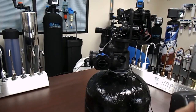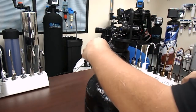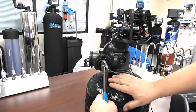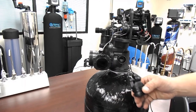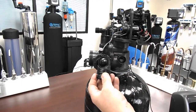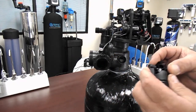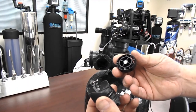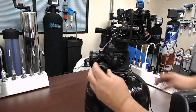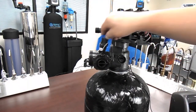Servicing the turbine meter is very simple on the 5810. Depressurize the valve, push in the meter cap, and remove the blue clip. Use a pair of pliers and pull out the turbine assembly. Remove the turbine and make sure that it spins freely. You can remove the turbine from the post and clean it if it has any debris or buildup. The meter lines up into a keyed section so it can only go in the correct direction. Reinsert the turbine and the blue clip and you're ready to go back online.